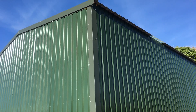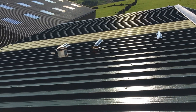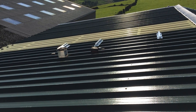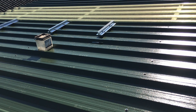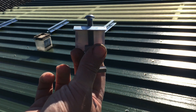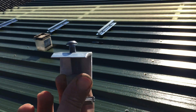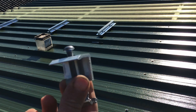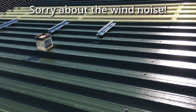The first thing we need to do is screw these rails to the roof — that's what the solar panels are actually attached to. So that's the first row of solar rails attached to the roof. Now I'm just going to put the end clamps on, which just slot into the rails and hold the panels onto the rails. The center ones go between two panels and these are the end ones.